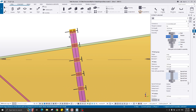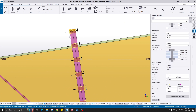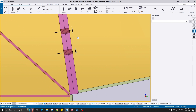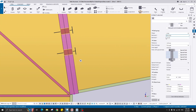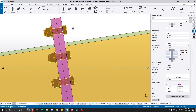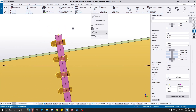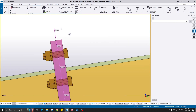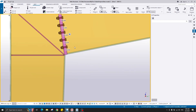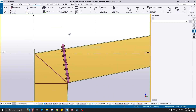We should give a distance DX offset from the origin of about 30 — yes, that's perfect. Let me increase to one more bolt — let's change to 7. Let me check the distance: go to Measure, hold spacing, select the bolt and the plate. Here it is 60, 60, and 100, and this side is 110. This is correct.